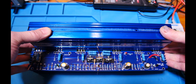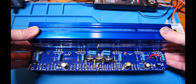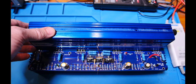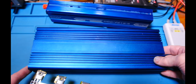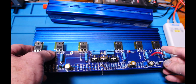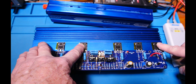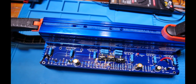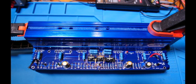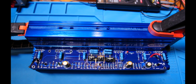I'll use some clamps to hold the heat sink down in place and I'll take a thermal picture during the test. I haven't powered it yet — I'm waiting for you guys. There's a little lip down here and it just fits these pads just right, so they lay right down inside that channel and it holds them in place so they won't slide. I've got a clamp on each end and tested that it'll hold them level with nice even pressure.